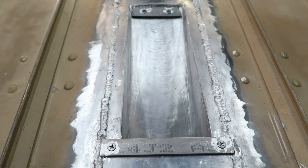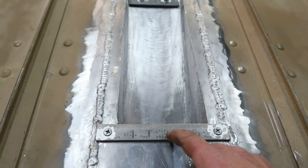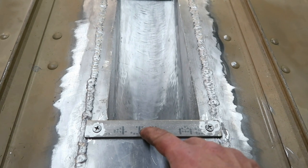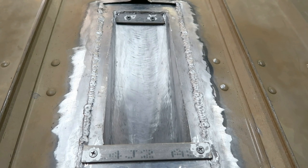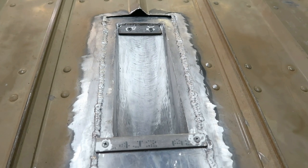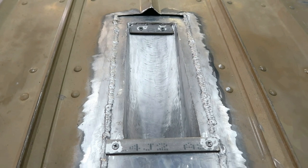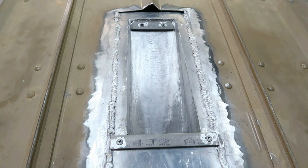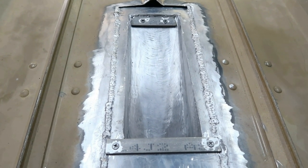When you weld aluminum, it starts out with a cold weld. And when you're only welding distances of half an inch, little beads, it doesn't give a chance for the material to heat properly with these spool gun units, and you'll end up with bad welds. There's pictures online of people that had made their own aluminum intake grates, and they actually came apart, got sucked in through the pump, and grenaded the whole intake shoe, and the motor actually jumped out of its mounts on several occasions. If you're going to be making your own intake grate, do it out of steel.